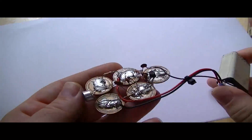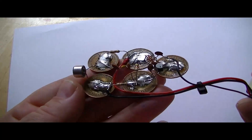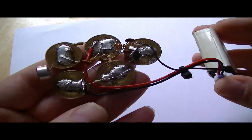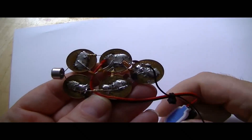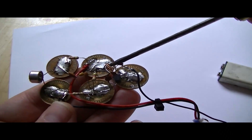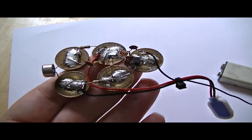These are 100% copper pennies, because I think after 1994 they made them out of something else. Crazy, isn't it? And it works. So basically you can make one of these without any special parts at all. It isn't using a variable capacitor either. What I'm using to adjust the frequency is the six-turn coil — push it in to lower the frequency, and expand the coil to raise the FM frequency.